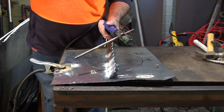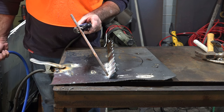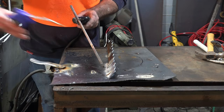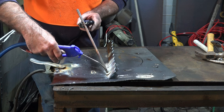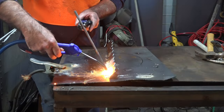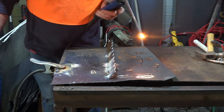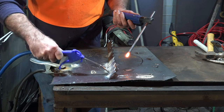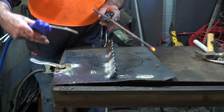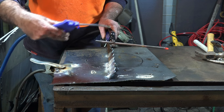So like I say guys, what I've been doing is just using the normal electrode holder, sticking the carbon rod in it, and yeah, just trying to gouge out some metal. But it really needs the air, so I just grab my air gun and point it towards it. As you can see guys, it does work — it's starting to knock the weld out here a little bit — but you need about 30 hands to do it. So I thought I'd see if I could make a bit of an air attachment so I don't have to hold it in the other hand.